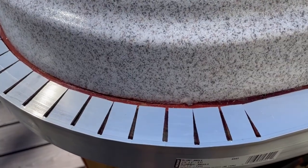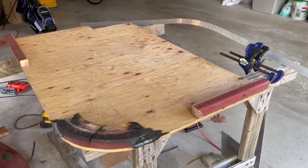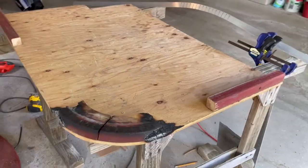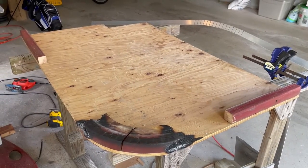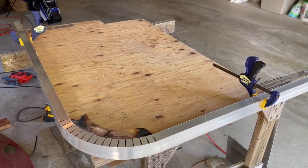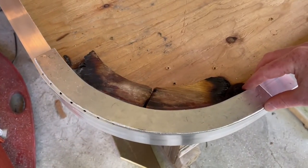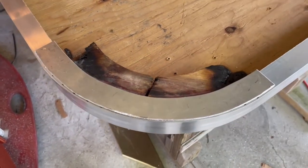I'm going to take this video a step further - if it needs to be aesthetically pleasing there's something we can do. I've moved into the garage with a scrap piece of plywood on sawhorses, checked it for square, and knocked off the corner to recreate the same curve as the hot tub. With the L channel clamped to the plywood matching that curve, here are the gaps we're trying to cover. The fix is a piece of 1/16 inch aluminum sheet metal cut to match the curve, used as a cap. It will be attached through a process called brazing - aluminum brazing.